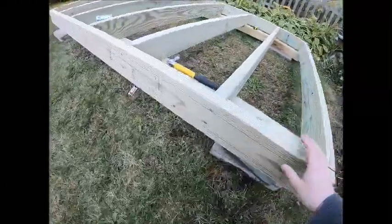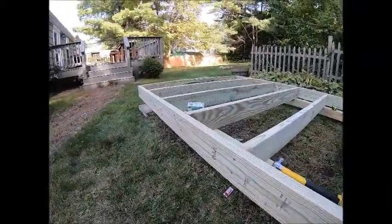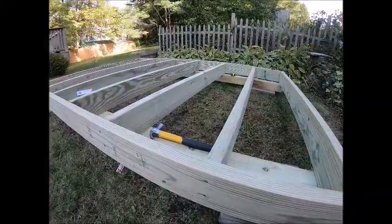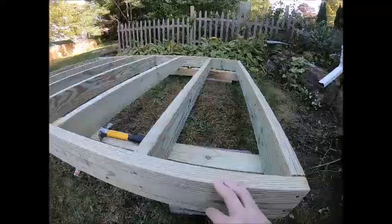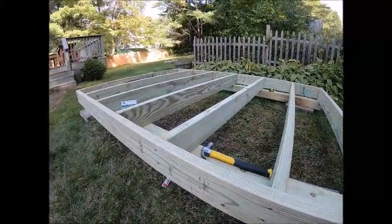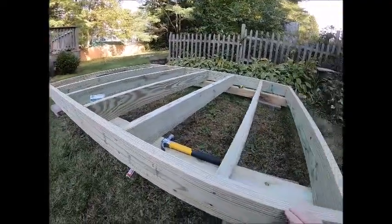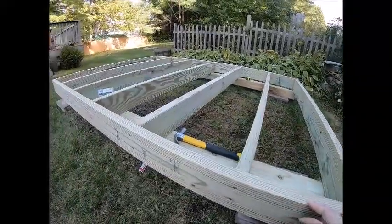All right, I just got all my stringers laid. 16 on center, 16 penny nails, just holding them in. Next step's just to lay the plywood, and then I'll run along the seam with a circular saw to get it where I want it. But yeah, hard to believe it took me 3 weeks to get a permit to build a 6x8 shed. But it's coming along. Weather's not really in my favor. It's quite cold today. But the sooner I get it up, the better. I need a place to keep my lawnmower and snowblower.